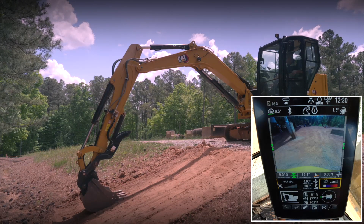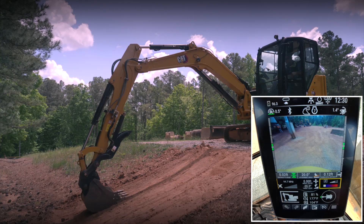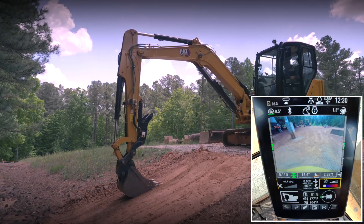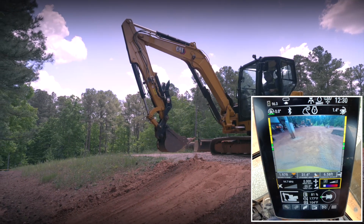I'm going to go ahead and enter that, then hit my trigger to bench it. On this first run I'm just going to check it against some work I've already done — and I come up at 20 degrees all the way up the slope. So now I can work parallel to my ditch or trench.